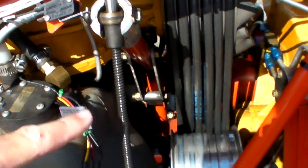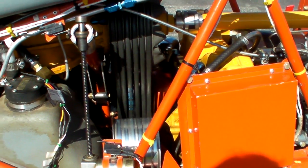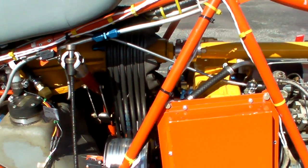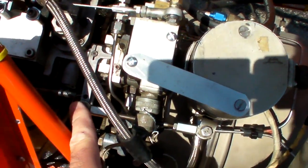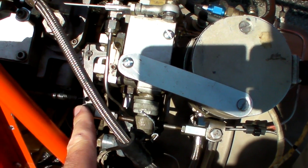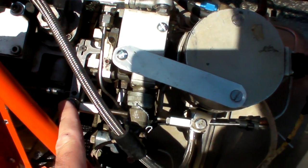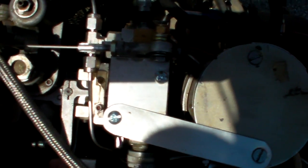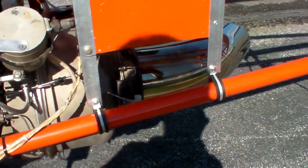We slowly engage this jack screw, which pulls the front of the engine down, tightening the belts which drives the engine. Those belts are set to 45 pounds of pressure when fully tightened, so if you try to pull more than 95 horsepower, they'll slip. Furthermore, the throttle — where my fingers point here — has less than about three-quarters of an inch of movement from idle to full throttle. It has little set screws to limit the travel, and that is how we limit the power.